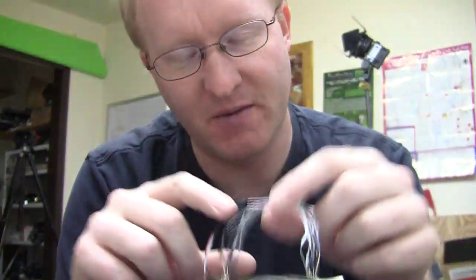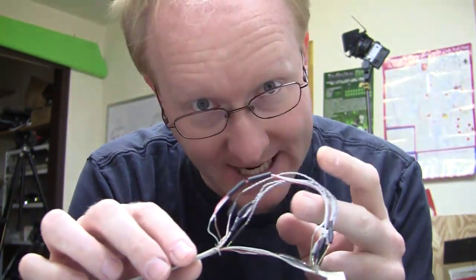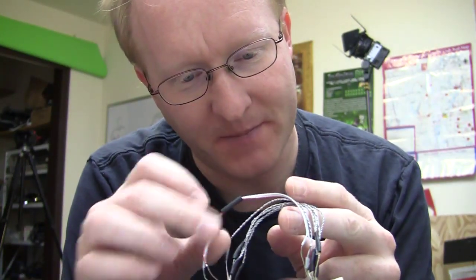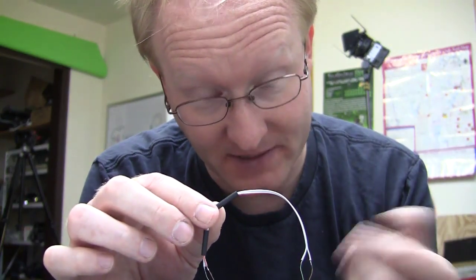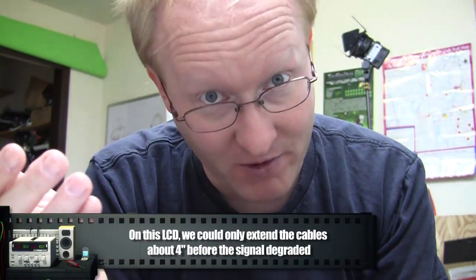I'm extending all of the wires, but I can only extend them one or two at a time because if you use the wrong thickness wire it causes it not to work. I had to use the thicker wire to keep the LCD backlighting working. The key rule is: only make one or two modifications at a time, then test. More modifications, test. That way you can rewind one step like an undo button and find out where the problem was. If you hack too much at once, you'll never know where the problem was.